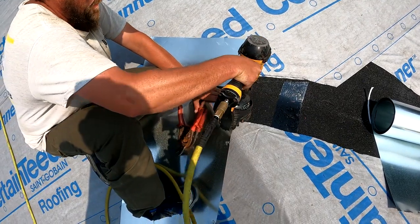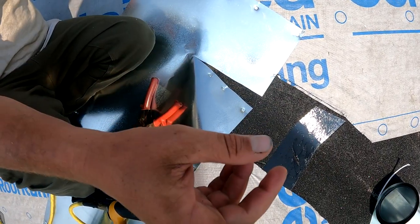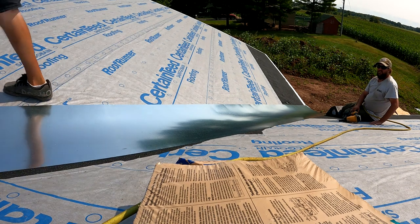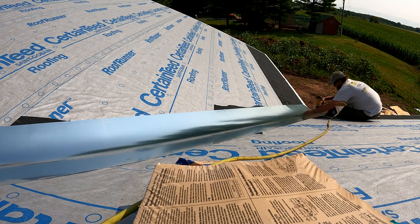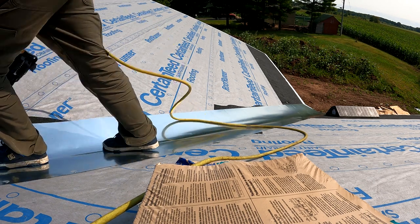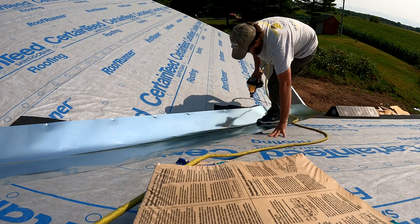We got nails, we're going to nail this. There you can see how that goes, and we're going to continue the same process on this side that we did on the other side. Then I'll show you how we finish it off when this piece comes up over here. Again, nailing one side and one side only. Then we're going to get in the valley, make sure it's tight. Nail it where it's nice and flat, no wrinkles, because that will show through on your shingles and we don't want that.